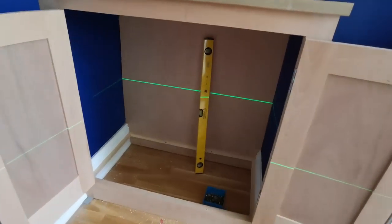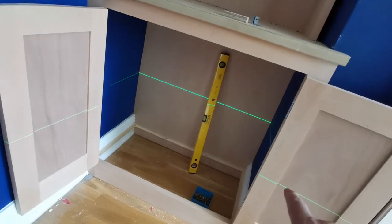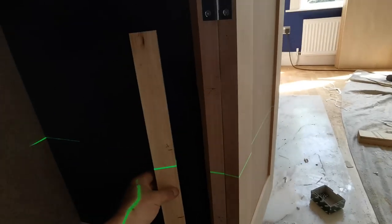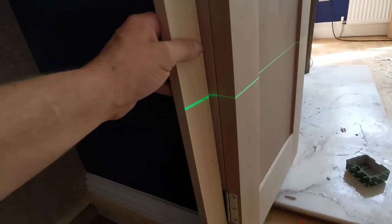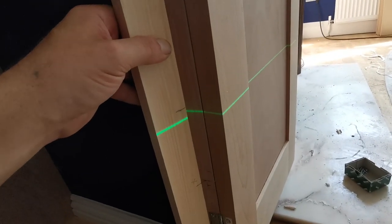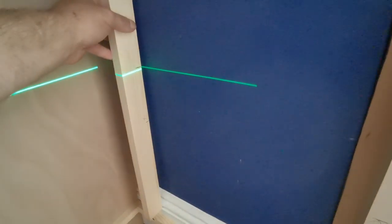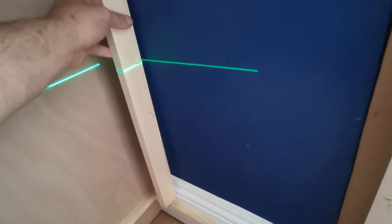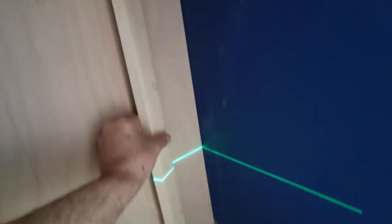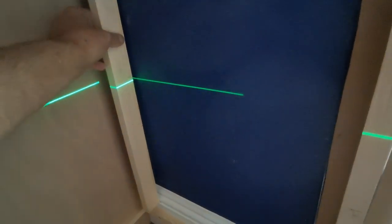I think I'm going to use my laser just as a datum mark — I can measure up and down off that, which helps me get it around. And rather than using my tape measure I'm going to use this stick with my marks marked on there and the laser. That's all I have to do is offer that up to my laser — cut a bit off the bottom actually — then offer that up to my laser. I'll be able to put my two marks from that; just need to trim it off a little bit to get it in there.